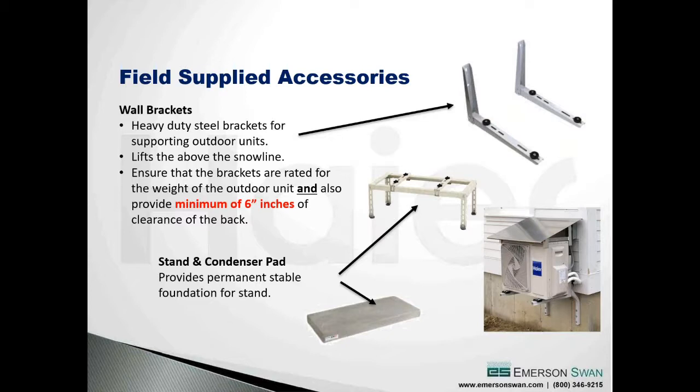Try to keep wall brackets low but still above the snow line. Use vibration isolators between the unit and the bracket - but don't crank down on the bolts and compress the isolation, because compressing it defeats the purpose. Get it snug then lock it with a lock nut or double-nut it. Also be mindful of where on the house you're attaching it. I had a contractor call about a noisy unit that turned out to be mounted under the windows off the master bedroom - probably not the spot I'd put it.